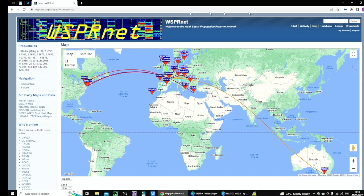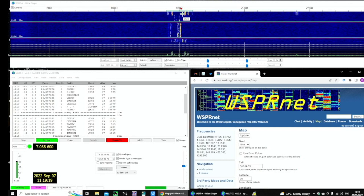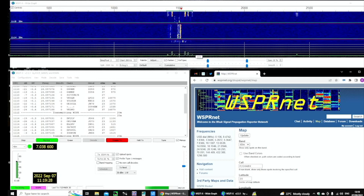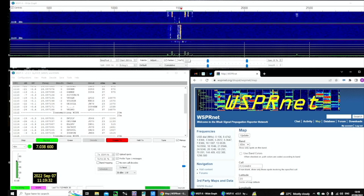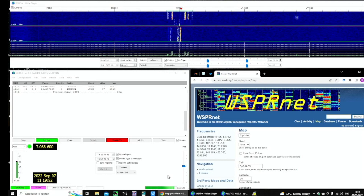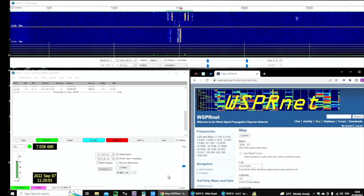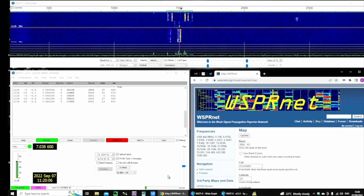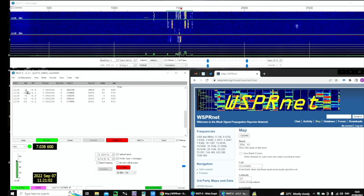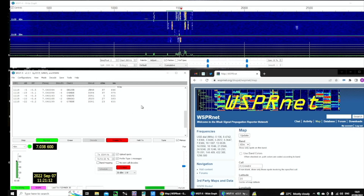I'm quickly going to move to 40 metres now — so the next transmission will be on 40 metres. Checking where my signal will come out in frequency terms, it's in a fairly clear area with just a couple of strong signals nearby. I encourage you when setting up WSPR to check you're not sitting on top of somebody else. WSPR testing is a bit like watching paint dry — not terribly enthralling, but interesting. You can run all kinds of tests overnight and check grey line performance. We've received a number of Europeans on receive: DKs, G4s, ON, G7s. I imagine the transmission will be of similar distance.